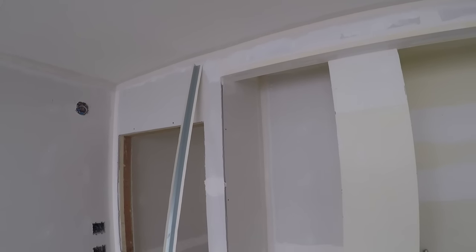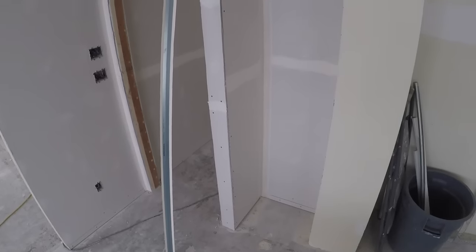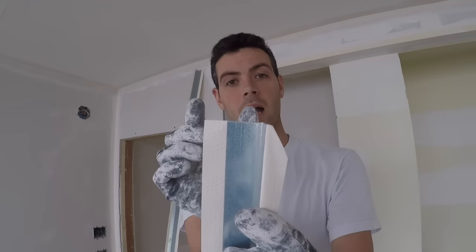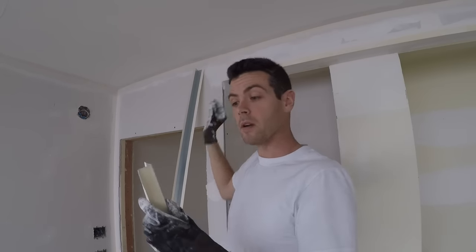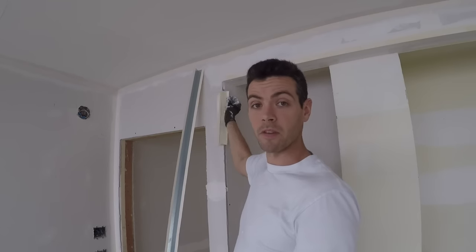So the first thing you need to do is cut your corner bead to length. We've got a corner bead that butts up to that one and then goes down to the floor. I also want to note what kind of corner beads I like to use — these ones you have to actually go to a drywall supply place to get. The metal flange inside is very wide, and why this is good is it will cover gaps. There's a big gap here and the wide flange of this bead is going to cover it so I don't have to pre-fill that.